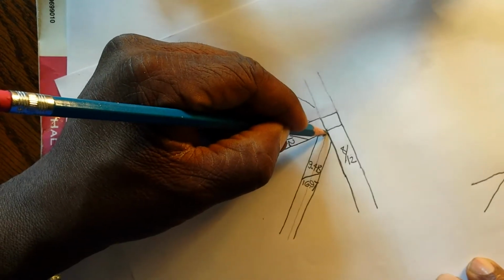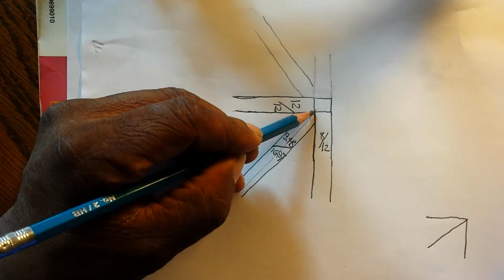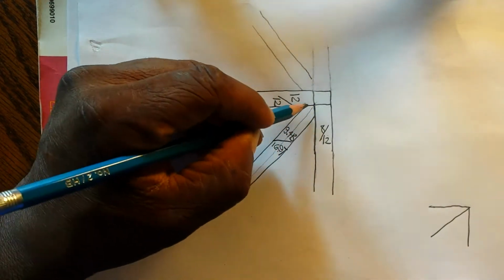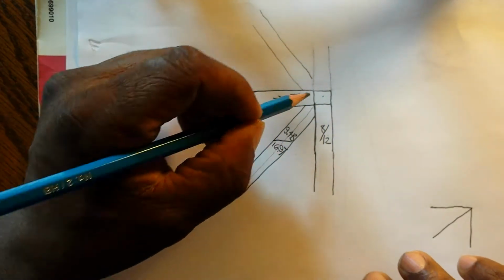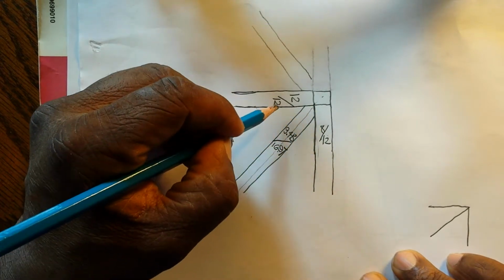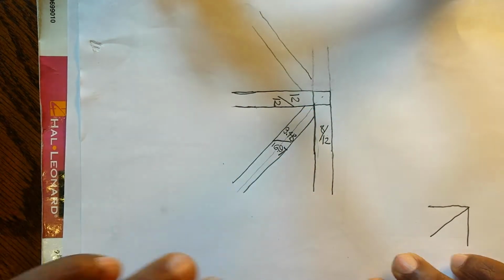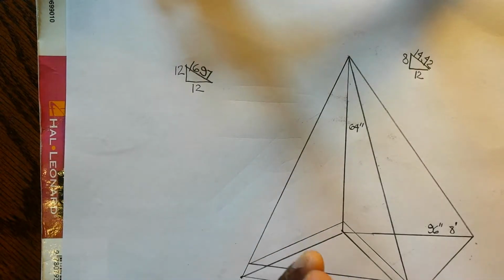And this line represents an imaginary line that runs right down the center of the hip. It's the long point of the bevel of the hip here. And it stops right there. The way that I figure this, I don't figure it where it runs all the way to here. That's not how I do it. I figure to the long point of the bevel, which basically intersects with this line and this line. So that's the longest point. I just want you to know what all of these lines represent in proximity to the actual framing, so you don't lose your bearings.